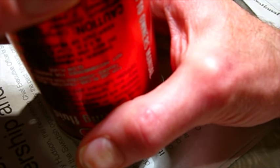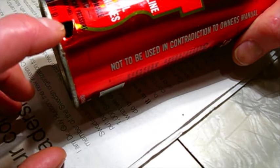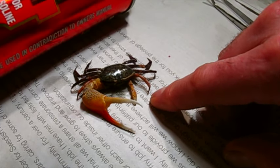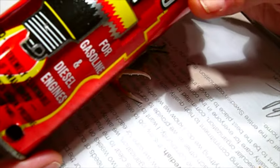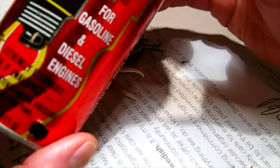I had a can of starting fluid. This stuff is very flammable and very toxic, and I had lost the spray tip on this one. So I turned it upside down in a jar and released all of the propellant — since the tube goes up to the top, it let all the propellant out. Once it was completely discharged, I took a screwdriver and punched a hole in it and drained the fluid out. This is an aerosol can with a propellant — it's toxic and flammable. This is not something you should do lightly; be careful. Don't be foolish.